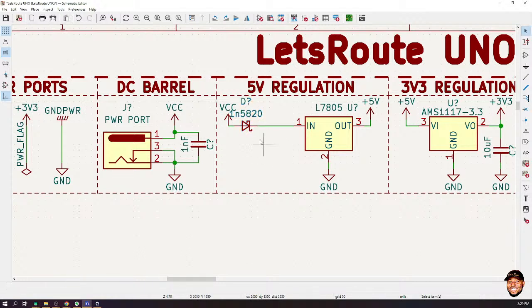Right now, what we are doing is protecting our circuit from the power side. There is one more thing that we want. This diode would only guard against reverse current, right? But there could also be an instance where something may short circuit our Arduino. You know, under the Arduino, you have the terminals and some pins showing, right? Assuming somebody mistakenly places the Arduino on a metallic surface, a lot will go wrong. Now, one of the things that is likely to happen is what we call short circuit. Short circuit can happen. And we want to prevent short circuit.